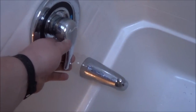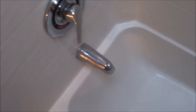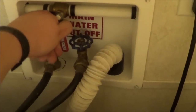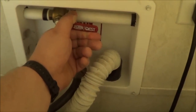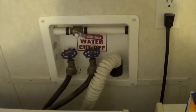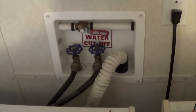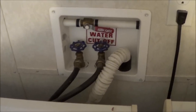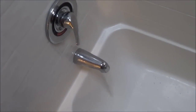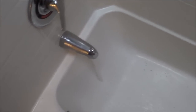The next thing you want to do is turn your hot water valve back on at the sink or tub, then go turn the water back on — either at the main valve or at the valve at the water heater — and turn it back on. You'll feel the water flowing. It'll take a little time to fill back up. Once water is coming through the sink or tub, let it flow a little bit more to get the air out of the tank. Let it run for a few minutes, making sure you get all the air bubbles out of the hot water lines.